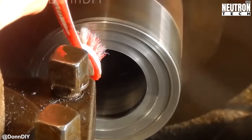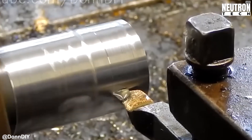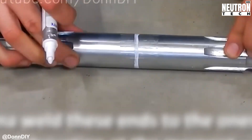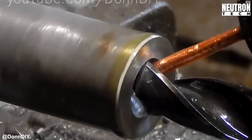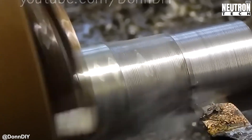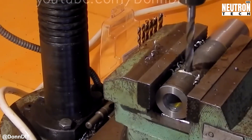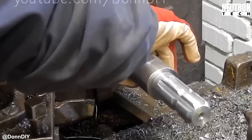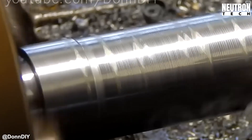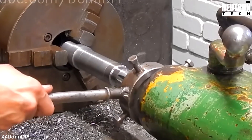The lathe becomes Don's best friend as he machines custom axles and threads, plus turns flanges for this crazy tracked amphibian. It's like watching a sculptor, but with metal and way more precision. He's mixing traditional turning work with modern MIG welding techniques to create protective shields around the wheel hubs — can't have water or debris getting in there. He's also picked up some specially designed waterproof wheel hubs for the idler wheels, because regular seals just won't cut it when you're literally driving underwater. That modified Lada-Fiat rear axle with its shiny new disc brakes is handling the power transmission duties like a champ.